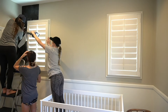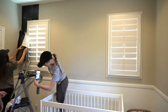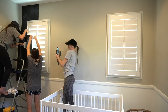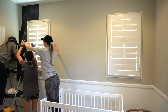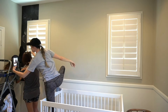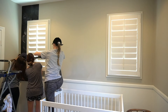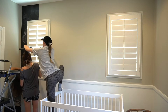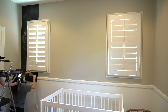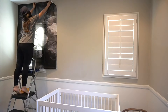After you're done lining up, cut off the excess from the top to get rid of that weight hanging down. Trim that away and then start cutting in on the wall side. If you're working with a window, you'll also be cutting in to the window — just make sure to cut a couple of relief cuts. Use your scissors and cut into the window a little bit so that it isn't as tight, and that way you can get a straight edge in and cut along the window and the wall at the same time. Since we subtracted two inches and measured our line at 23 inches rather than 25, that ensures we don't have any gaps. Even if our wall isn't straight, we won't run into a problem where we're short any wallpaper — that two-inch buffer really gives you peace of mind.